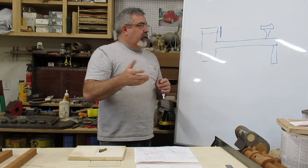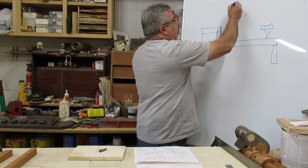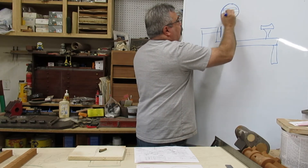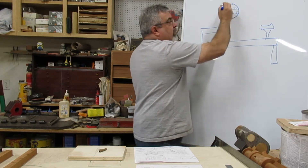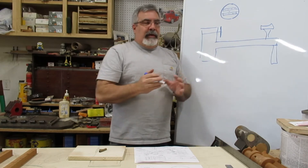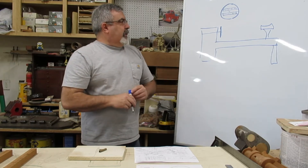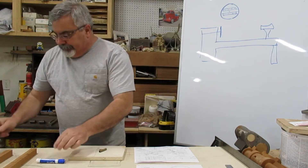We used to do a lot of pump work — making impellers and hubs. If you don't have lathe centers, one thing you could do is screw a couple pieces of wood to your faceplate evenly as a makeshift center, and make up a little block at the other end. It's probably not going to be as accurate, but if you're just starting out, you could do something like that.